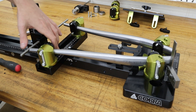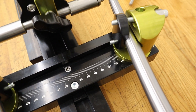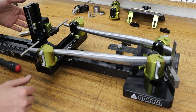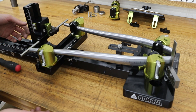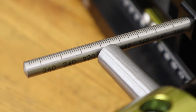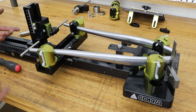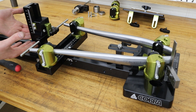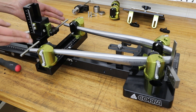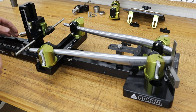Back here we have a laser-etched scale for centerline spacing — you can sight against the fixture posts to achieve symmetry, or account for asymmetry from disc brakes or a chainstay yoke. Back here is the stay rod, labeled with a laser-etched millimeter scale — really expensive and tedious to put on there, but I think it's important. The stay rod is held by the dummy axle holder.